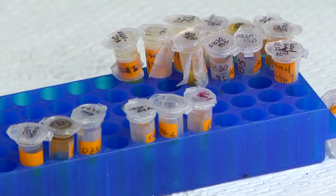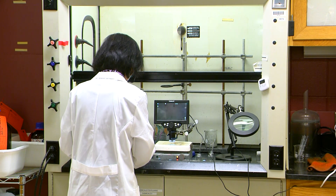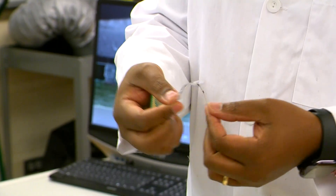Most of the electronics we enjoy today are rigid electronics — a rigid circuit board with rigid components. But there are being put on, like automotive or aerospace or even smartphone applications, a lot more restrictions on what they need to get the next designs in there. And so when you start to make things smaller, when you heat them up, they start to curl and they start to deflect. And when you have that deflection, you get a lot of defects.